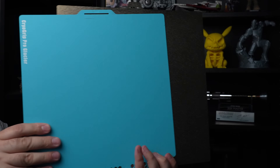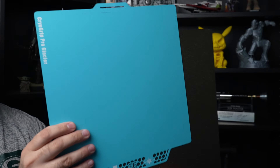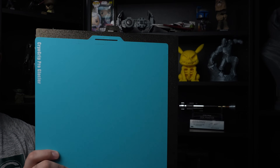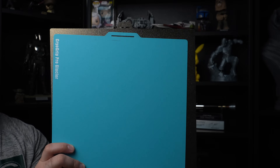The first one is the build plate size. We're looking at 270 by 270 by 256 millimeters cubed, as compared to something like the Bambu Lab A1, the P1P, the P1S — those are all probably 3D printers you're looking at in this price range, and those are at 256 millimeters cubed. When I was actually using this 3D printer, I really didn't find myself using that extra space. Most modelers are making stuff to fit on Bambu Lab 3D printers. That extra space is nice to have, but it's only 14 millimeters in two directions — it's not going to add too much.